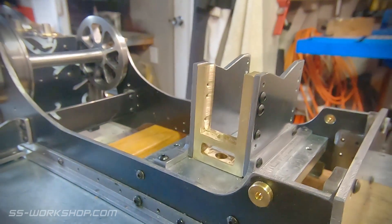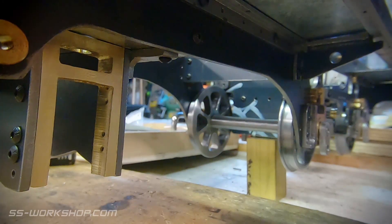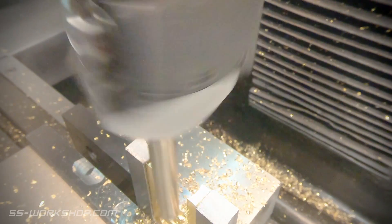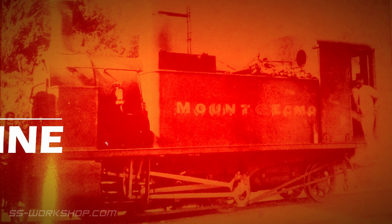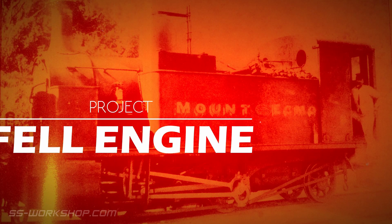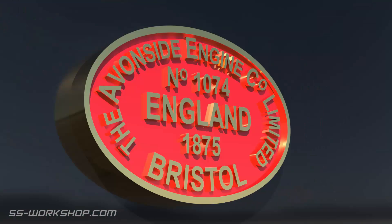On this episode I start to make the radial axle assembly and more specifically the steel welded frame and brass bearing blocks. I give my new fly cutter a test run and I get an opportunity to use my boring head as well. Welcome to the fill engine project where I'm building a three and a half inch gauge live steam locomotive to my own drawings.